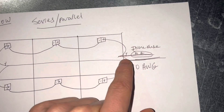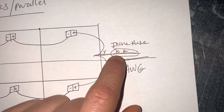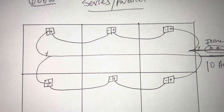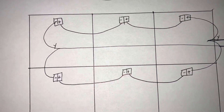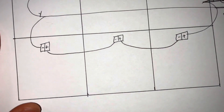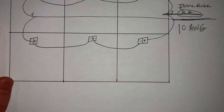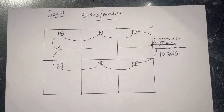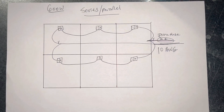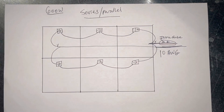On the positive we have another Y connector with a 10 amp inline fuse. It's all 10 gauge wire. So in between those we go positive to negative, positive to negative — and same thing on the other side. That's how I connected my panels so I could stay at a lower amperage rate and keep the 10 gauge wire.